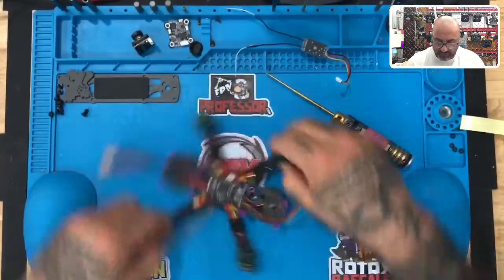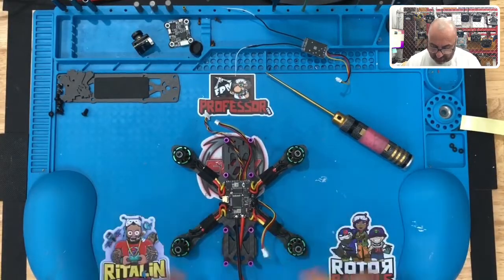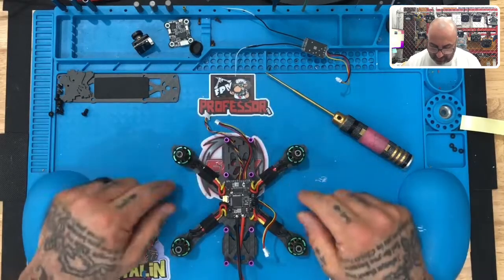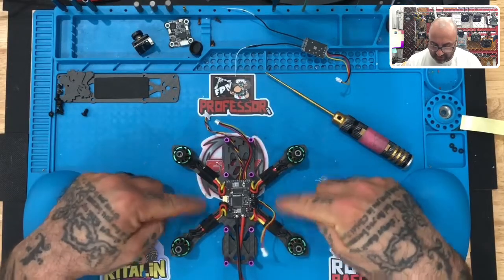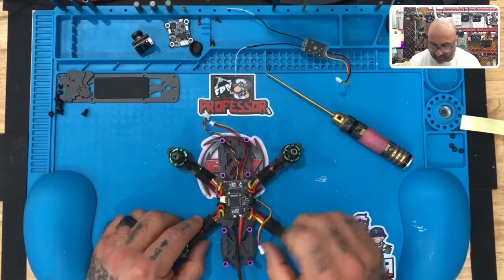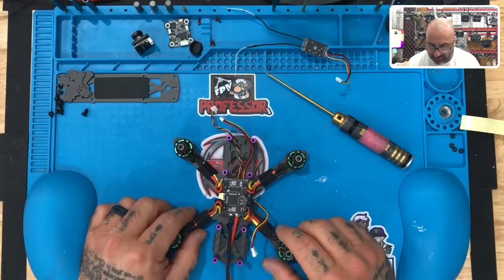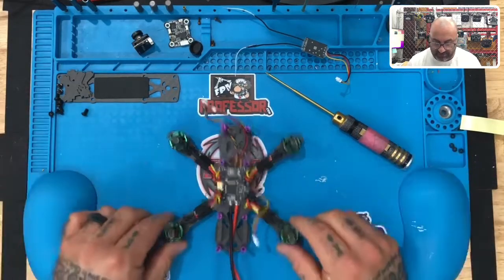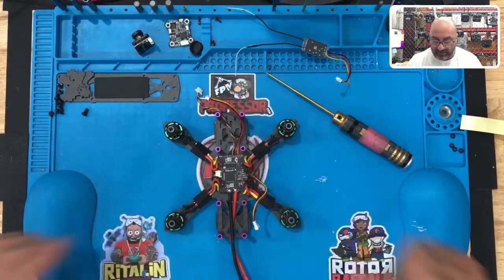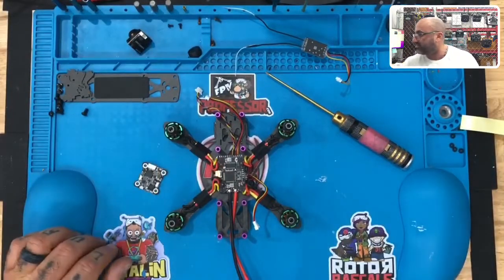We are officially done wiring our motors. What you should have is something that looks like this. If aimed in the proper direction, you should have yellow on the outside back, yellow on the outside front, black on the inside on both, and red on the top. If it's flattened out like motor one, that's okay — you can press it down and flatten them, it's just a preference. The next thing we're going to do is plug in our components and install our VTX. See you guys in just a second.